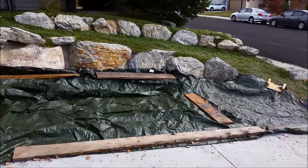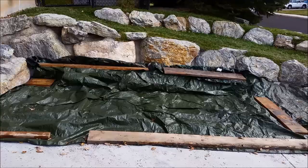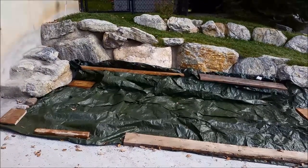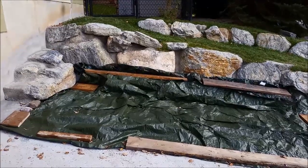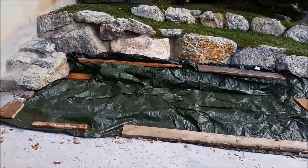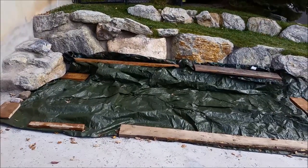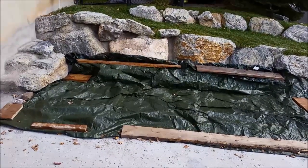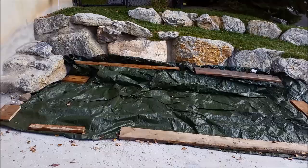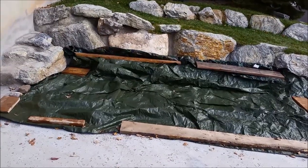The only issue is you don't want to let it freeze overnight. Anything below 50 degrees is not very good for it, so the mid-40s right now isn't great. But hopefully it's warmer under the tarp — with a little bit of sun on it, even though it's cool outside, hopefully it's warm enough in there to keep it curing and stay humid. Let's take a look underneath.